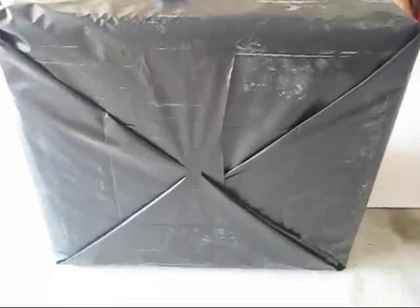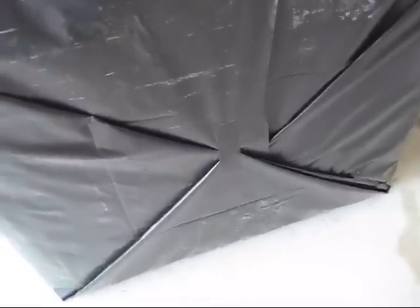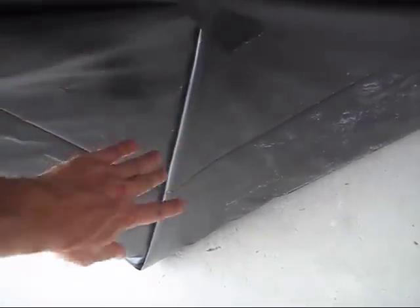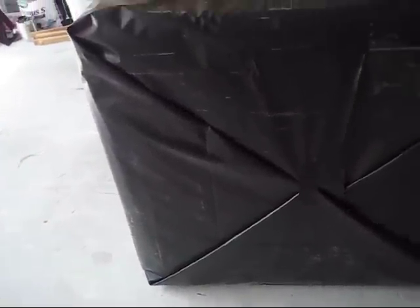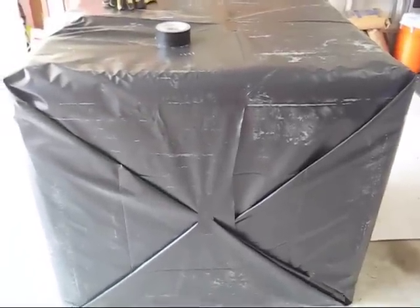Now I'm done with the second side, and it is time to tape every seam. I start with all the seams that are closest to the plastic, then do the seams furthest away — just because my thinking is it helps in case it rains and water might get underneath. Does it make a difference? Probably not, but that's just how I always think: overlapping, so water doesn't get inside. One thing I want to mention first is that I take my gloves and wipe off the seams, because even though I swept my garage floor it's still dirty, and I just want to get a good seal on the tape. I think it makes a difference.